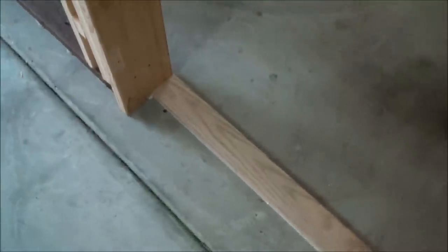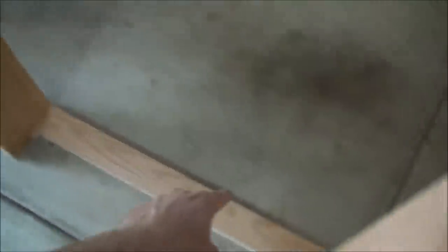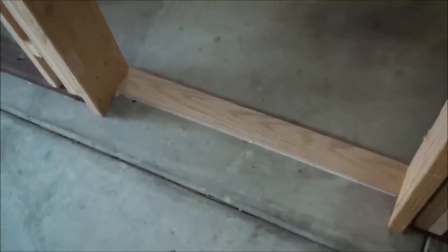On the bottom here, there's a little step up on this side, so there are two thresholds that go down here. This one's raised a little higher than this one, because this door is going to open up this way and the floor slopes down that way. So this end of the door is lower than this end of the door, so when this door opens up it would hit the floor over here. So we can raise the door up a little bit, get it off the ground, so we don't have to worry about that crashing into it.